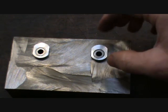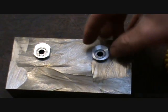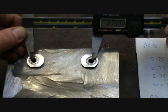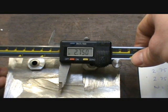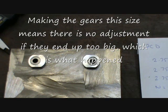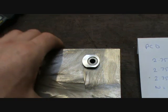What I ended up doing was making some sleeves. These are a couple of sleeves which sit into these holes here, which gives me adjustment. I've measured the centre between the spindles and it works out about 2.75 inches. I'm going to be using a 12 diametrical pitch cutter.